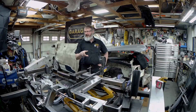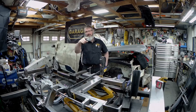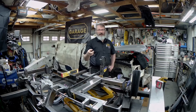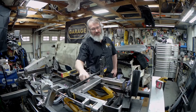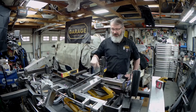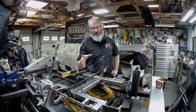Working on it for about a week means I'm standing out here in the garage a lot, just looking at it and trying to figure out if I'm right. It's really difficult to do. I've already used levels and done a whole bunch of calculations to get the steering located in the right position, which means this crossmember has to be located in the right place. I've been losing sleep over some of the connections, so I'm going to make up a few gussets.